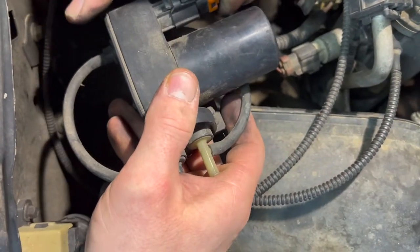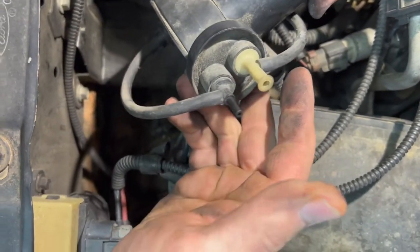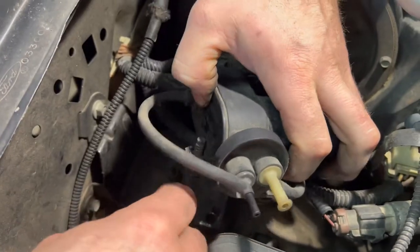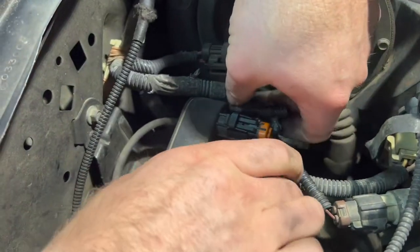We have voltage here. The pump and the regulator in the pump are working — it's reaching 15 pounds of vacuum immediately when you cover it up. The regulator inside is telling it to cut off, so that's working. Now we're going to hook it up to our system to see if it produces vacuum and cuts off.